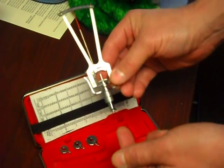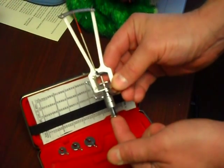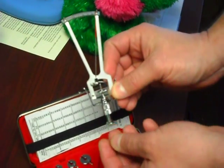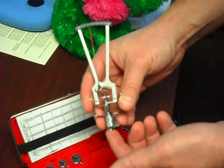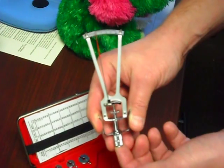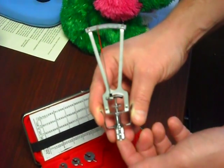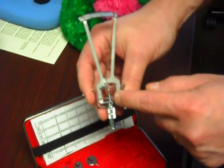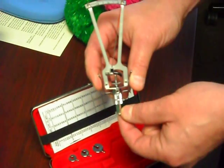When you first pick it up, you want to make sure it's clean. Get a little alcohol and wipe this up. You want to make sure that this plunger is free falling so it's not sticky. Then basically what you do is put your hand in there and make sure it's zero. When it's flat, it reads zero. This is the 5.5 weight — you don't need to touch it or diddle around with it. Just clean it up and make sure this thing is not sticky and flowing.